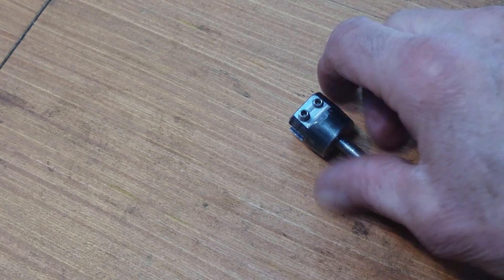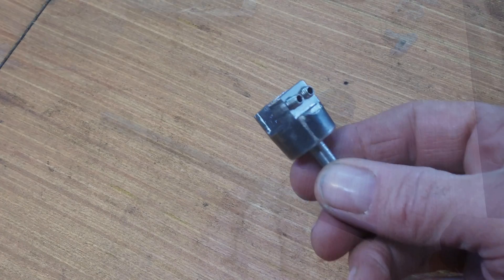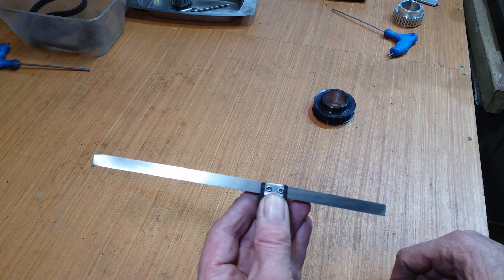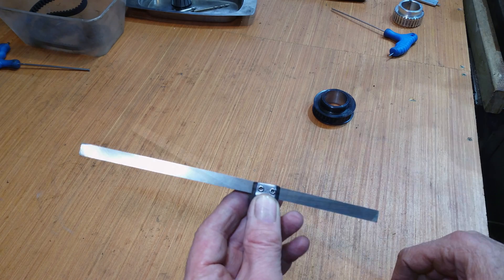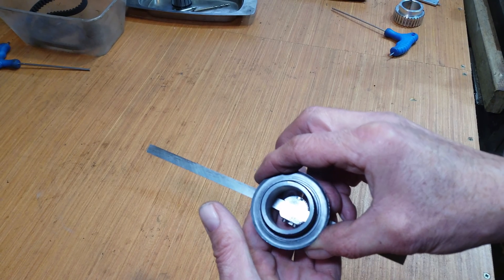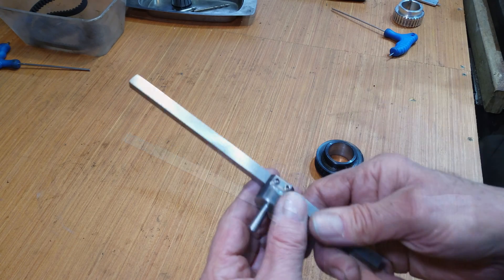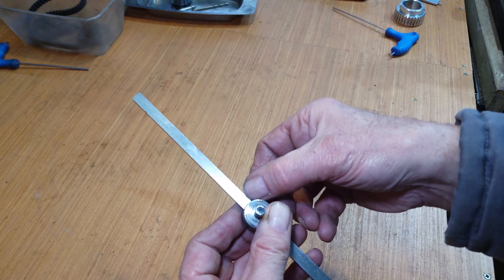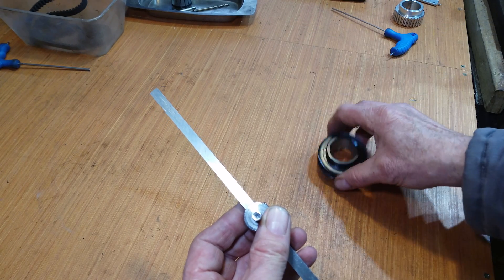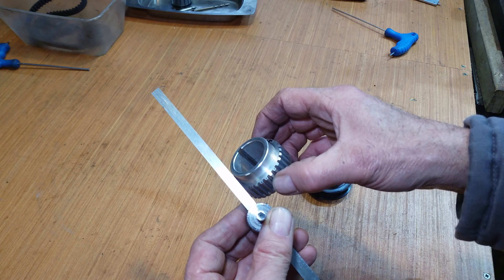And there's the finished product. So I think the first thing to do is cut a piece of this tool steel off that we can use as a bit. Obviously we don't want too much steel because it's got to still fit inside the bore of the pulley. I'm also going to have to grind this 8mm width down to 4mm because the keyway we're cutting is 4mm.